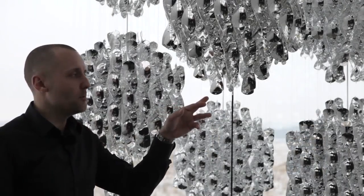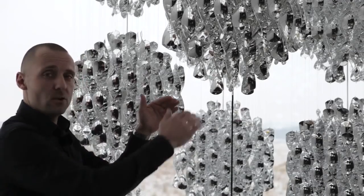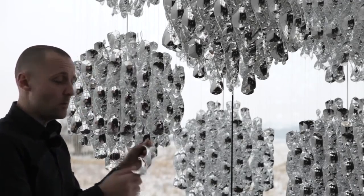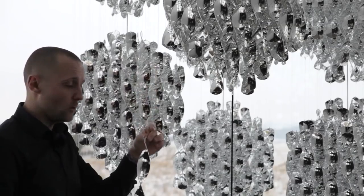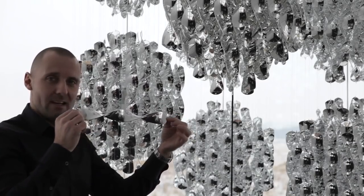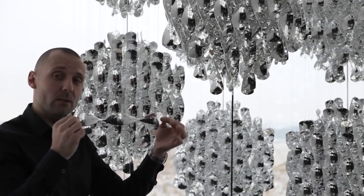In the bottom of each spiral there is actually a small hole. The reason for this hole is two things: one is that it gives you the possibility to build further spirals. But most importantly, for the versions we make in chrome, you cannot simply dip the spiral into chroming — you need to suspend the spirals from two points to hold them, and that is why you need two holes.